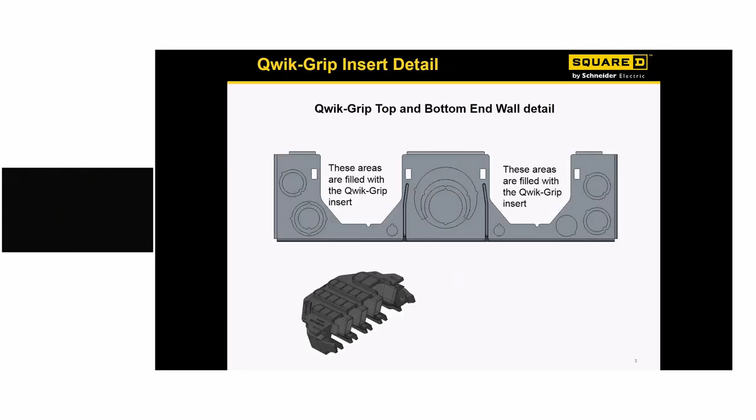Looking closer at the center KO, you'll see some strengthening punches that give good, strong rigidity in that end cap. So when you're punching that tangential KO out to bring your main line in, you're not going to be worried about it bending at all. On the bottom left, that is the Quick Grip clip that installs in that open area. And you can still see the KOs that are also there, giving you spots for your larger number sixes and number eights needed for your AC, ovens, and other things.